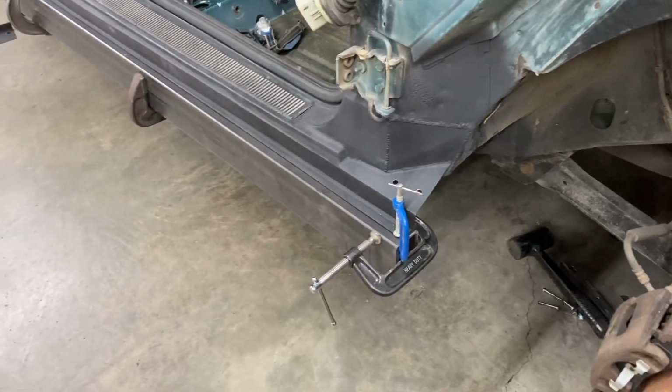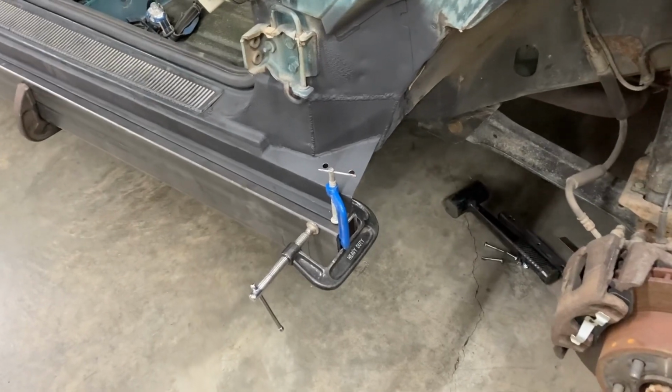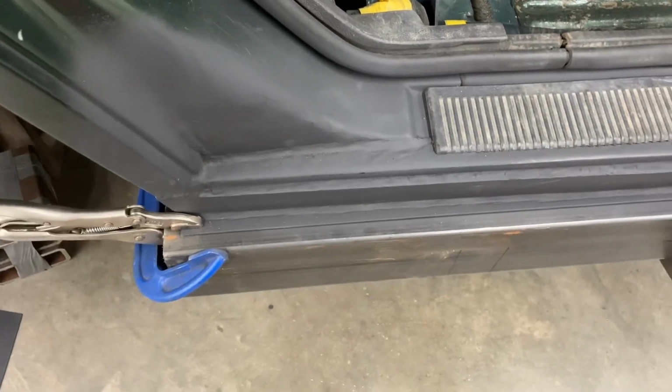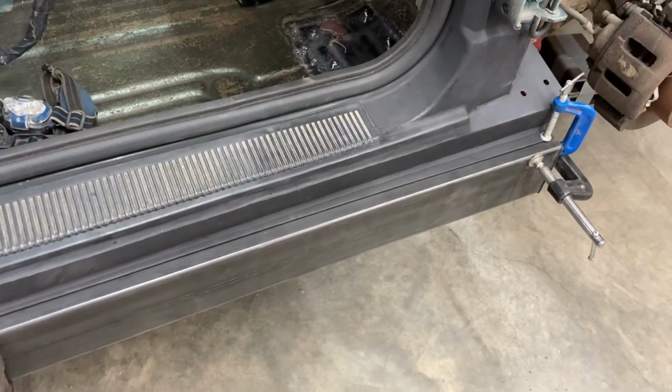We put our rocker slider on there, we got that clamped on, and we kind of finished up all our work on the exterior here where we ground down the weld and we put some of that high heat paint on there all the way down. So this portion out here looks pretty good. And again, what we're doing is we're continuing to work on this front receiver under here.